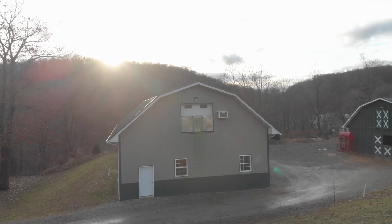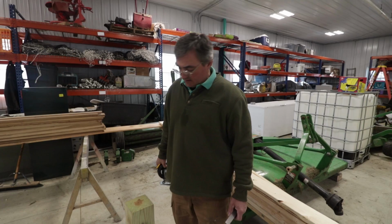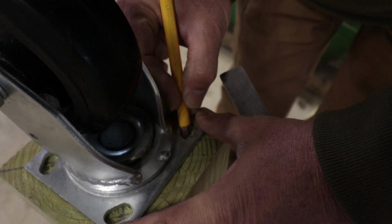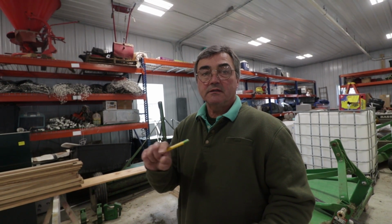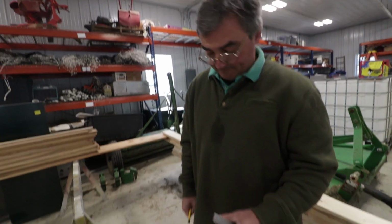Day 2 here, Dad. Set us up. All right, so we put the legs on yesterday, and now we're gonna set the casters on, and we'll just pre-drill some holes, and we'll do the same thing with the lag bolts that we did yesterday for the other screws. We'll find a drill bit that'll leave the threads on, so when we drill, the shank can go through, but the threads bite in. And we're gonna do that on all 4 of them.